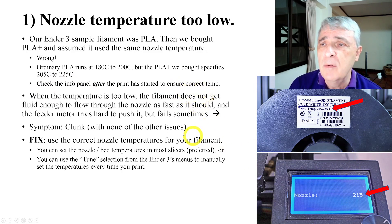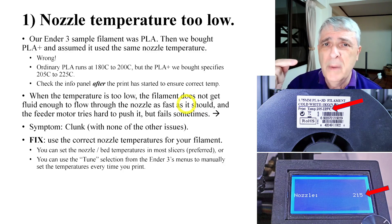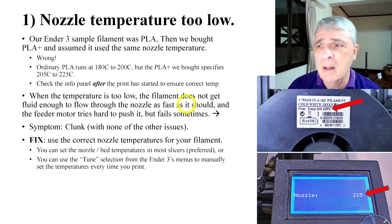It'll show up in the info window. If it's too low, what happens is the filament does not get liquid enough to flow through the nozzle easily. The little brass wheel starts to skip, and you'll hear it as a clunk. It puts pressure on the filament and tries to push it, but the filament can't go fast enough, so the wheel skips and jumps backwards — and you get that clunk.